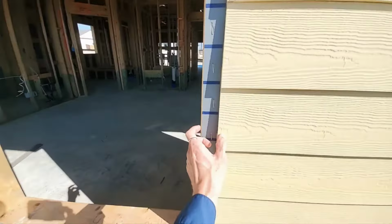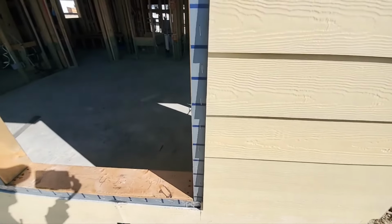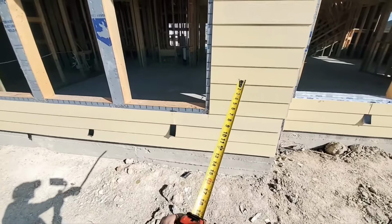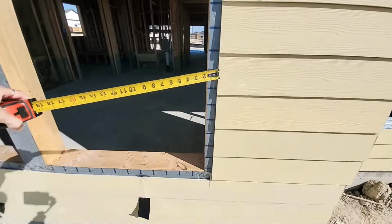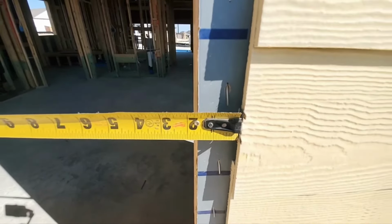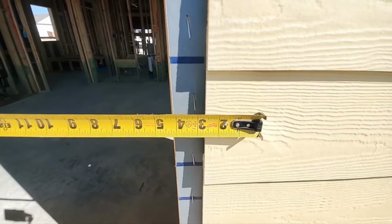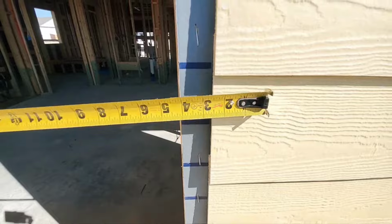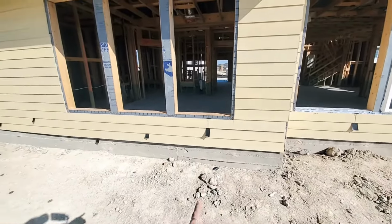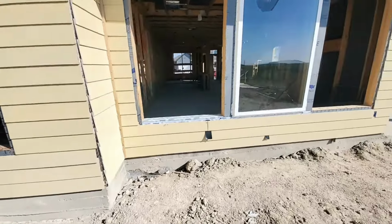However, this space right here, you should have 4 inches for that tape. Now, obviously, it's been sided up and really it's done totally out of order. But the way that they've done it, you've got less than 2 inches here to put your nailing flange, and you need to have 4 inches for that tape. Now, that's according to the manufacturer's installation instructions. Now, they still have an opportunity to do it right because the windows aren't in.